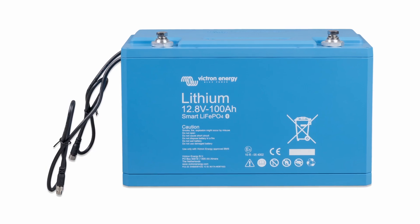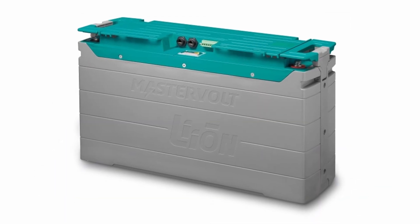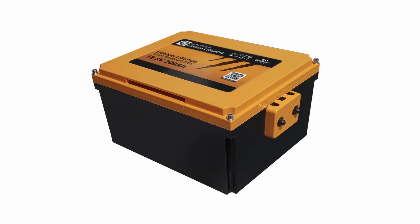Well, I think you're right in theory, and in practice it's fine. These batteries — particularly if it's lithium iron phosphate — are designed to be cycled 100 percent of capacity up to several thousand times, so it's fine, as long as the cells don't get out of balance and they're all being pulled down to around 10 percent.